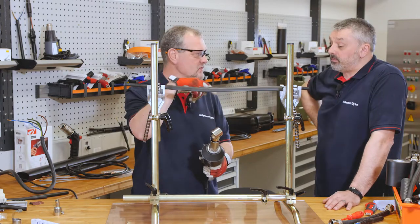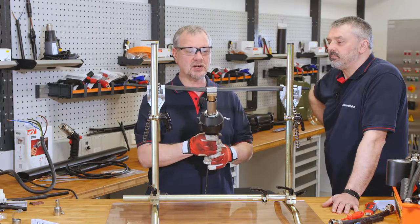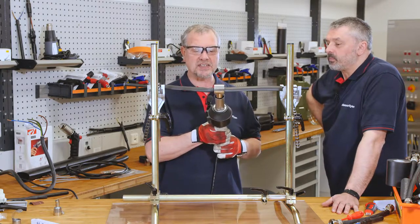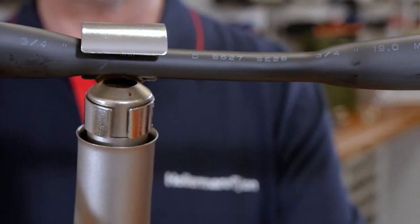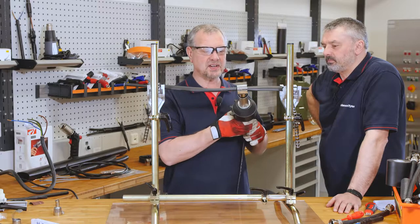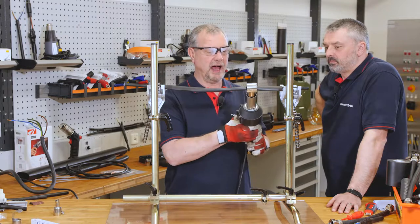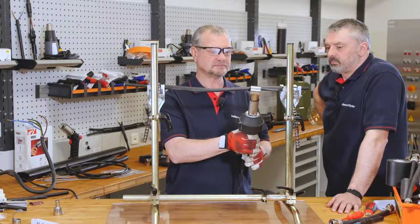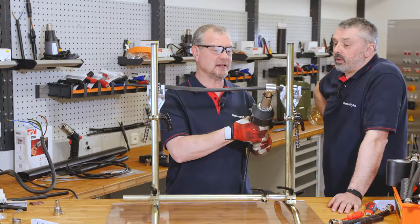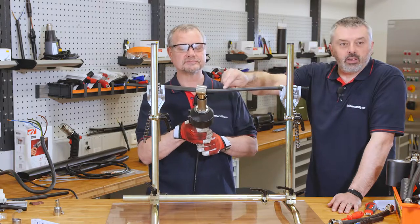It radiates the heat all the way around the tubing. Do we have these in our range? We have these in our range, yes, and you can also buy them separately. Now I'm starting in the middle, Barry — this is a way of making sure that your tubing is positioned very well on your cable. Having the deflector nozzle also means you actually shrink a lot quicker onto your cable. What wall thickness is this tubing, Mark? This wall thickness is a medium wall thickness. A thin wall thickness tubing would shrink even quicker. So this is a VG-specified tubing. Top tip: VG tubing always has markings on it every 25 millimeters.